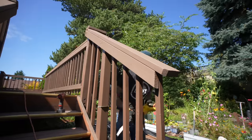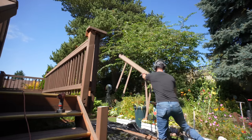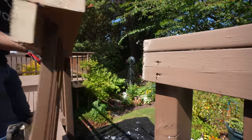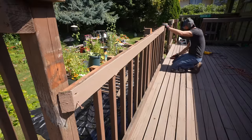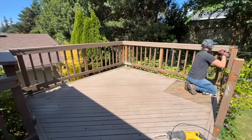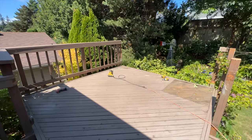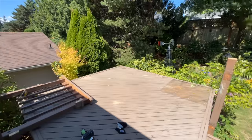These helpful tips will come in handy with new construction as well. The funnest part of any deck remodeling project is the demo portion because it's always satisfying to destroy something that's seen a lot of wear and tear — no exception with this old railing and the decking boards below. My all-time favorite tool for demo is a reciprocating saw because it makes quick work of many different types of construction debris, with multiple blade options to get through wood and metal at the same time.